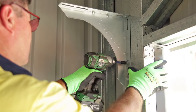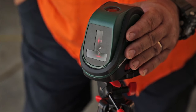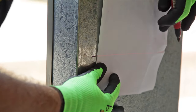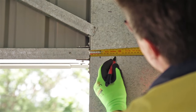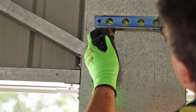To find the location of the second bracket you will need to use either a laser or water level. Here we demonstrate how to use the laser level. Make a mark on both sides of the opening along the laser level. Measure down from the top of your first bracket down to the mark. Measure up from the mark on the opposite side using the measurement you got earlier to determine where the top of the second bracket will sit. Install the second bracket using the same technique you used for installing the first.